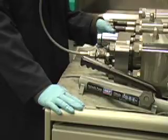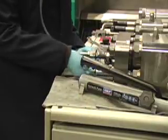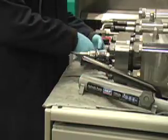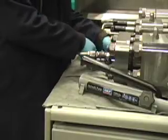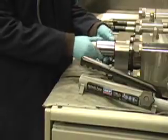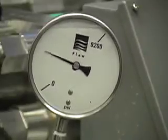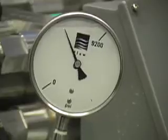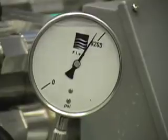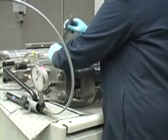Back the nuts off one full revolution. You want to pump to 9,200 pounds. After coming to pressure, loosen the nuts on the end cap in a figure eight pattern.